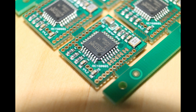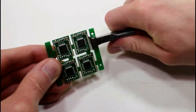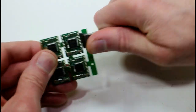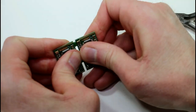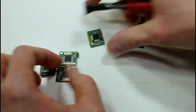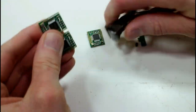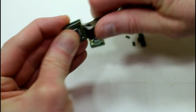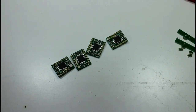To get the PCBs out of the panel I'm just going to use my snips to lever against the drill holes through the PCB — they snap off easily enough. This is another reason why picking the thicker PCB was a better option for us. If you'd picked a really thin PCB like 0.8mm, doing this would probably have broken some of the solder joints. But at 1.6mm the PCB is pretty resilient.